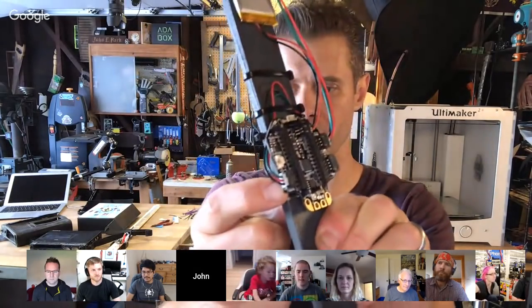But I am really happy about how this board works for this type of project, because we've got a sensor in 3-pin that I'm using for a potentiometer that I can use to adjust the rate of playback if I want to not squeeze the image. We've got a battery in and charging circuit, and we've got a little NeoPixel 3-pin plug there. So I've got a NeoPixel strip on here, and it's actually a very simple build that I will share with you the materials and how I made it tomorrow on the show, so tune in.